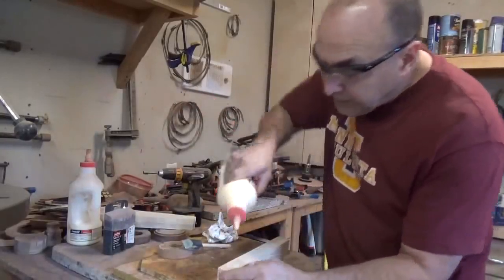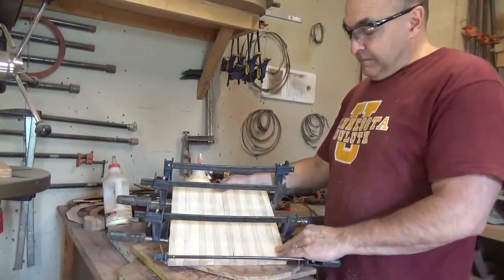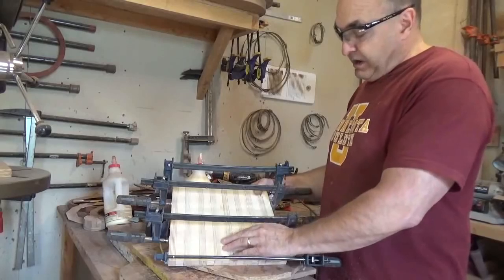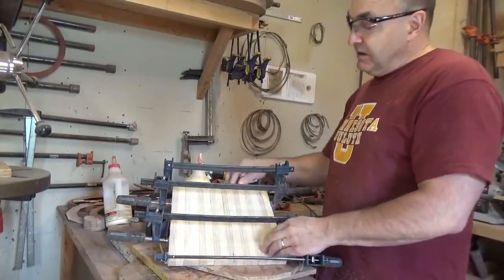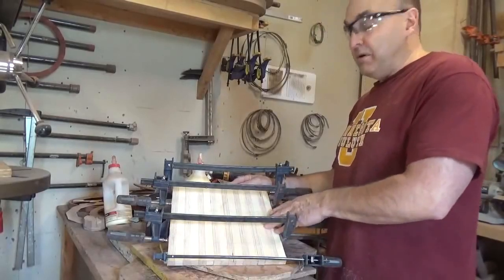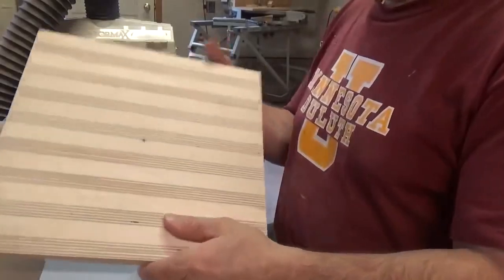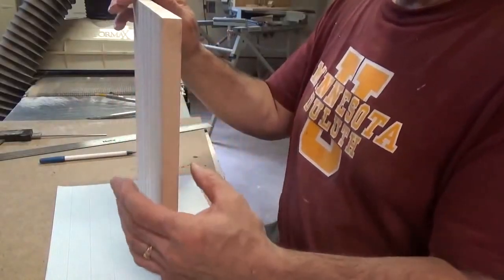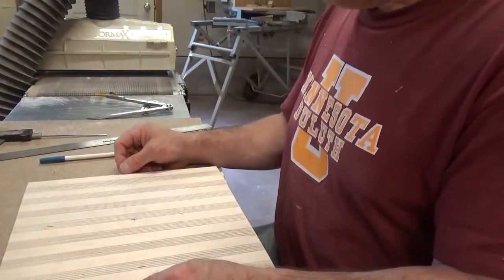This is the board all glued up now. Just for the record, I ended up making an eighth pair and glued it on here, because with only 14 pieces or seven pairs it was like 10 inches and this is 12 inches. I wanted to get it a little closer to square, so adding that on got it closer to 11.5 inches. After all the sanding the board is nice and flat — I lost two hundredths of an inch on thickness, it's 0.68 now, which isn't too bad.